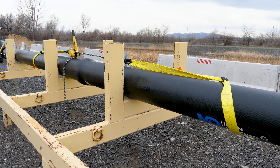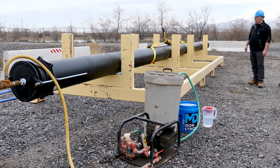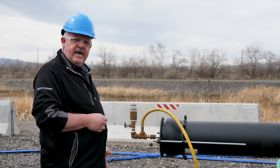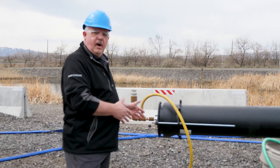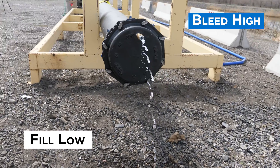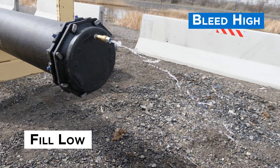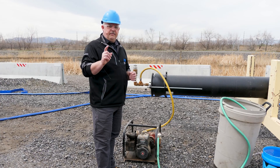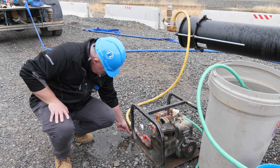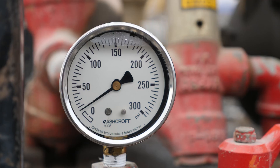We've taken this section of 12 inch pipe and slow filled it, ensuring that we remove all the air. We have here our pump and our gauge, which is located at the low spot, and our air release which is at the high spot. The test pressure should be the ultimate pressure that that line will see in its lifetime — that's different from the working pressure. Tests are usually conducted for two hours with a plus or minus five psi on the gauge.